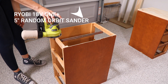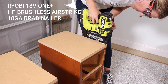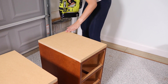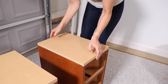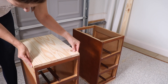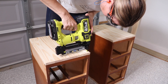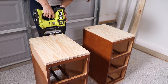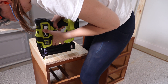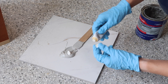I'm using my orbital sander with a medium grit sandpaper to smooth everything out before I add my new tops and bottoms. I'm starting with the MDF on the bottoms using my 18-gauge brad nailer — this is the new brushless AirStrike. I only nailed in the front and back because the sides are plywood and it was holding really well. I'm pretty obsessed with this brad nailer — I'm used to having a hose and air compressor, but this is way easier and runs on the same ONE+ battery.